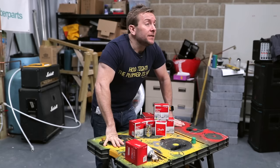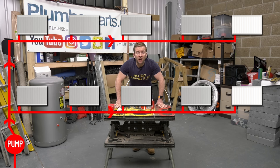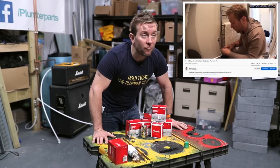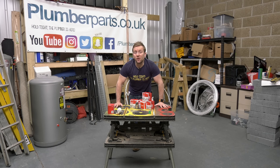So let's see it like this. We've got 10 radiators in a house. Usually on most heating systems, we've got one pump delivering hot water flow to all of those radiators. If one radiator is taking more flow because it's fully open and some others are a bit shut, we're going to end up with an unbalanced heating system. That means some radiators are being starved of flow — they won't get hot enough. You'll find other radiators are baking hot.